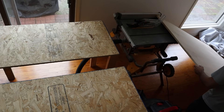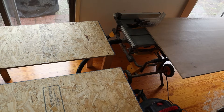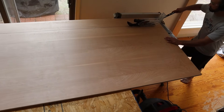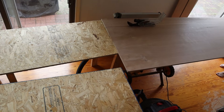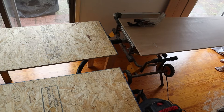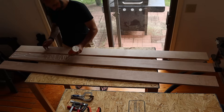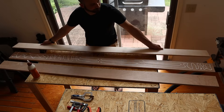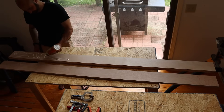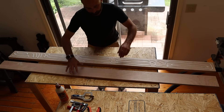I used a combination of half inch and three-quarter inch birch plywood. The boards I cut for covering the door frame were cut to 5 inches and the boards for the bookshelf were cut to 7 inches. I figured the 7 inch depth would be deep enough to accommodate most standard books, but wouldn't be too deep to prohibit the bookshelf from swinging open. For the right side of the frame I used two pieces of three-quarter inch plywood and sandwiched a half inch piece of plywood between them and glued them all together. This gave me 2 inches of material to set the hinges in.